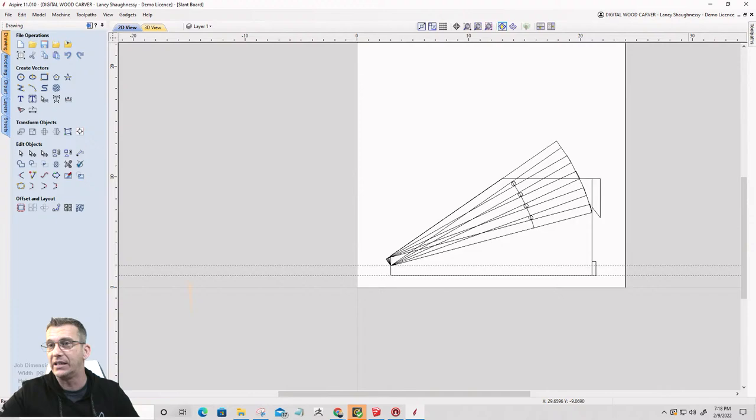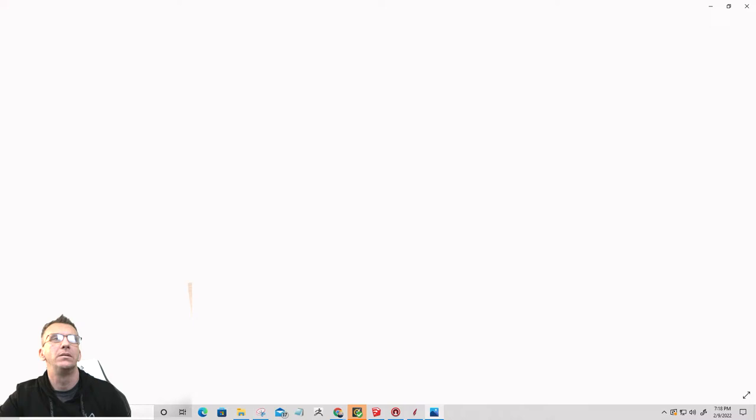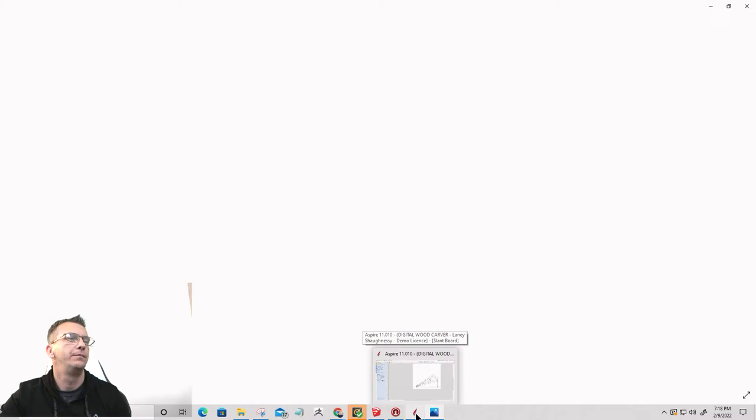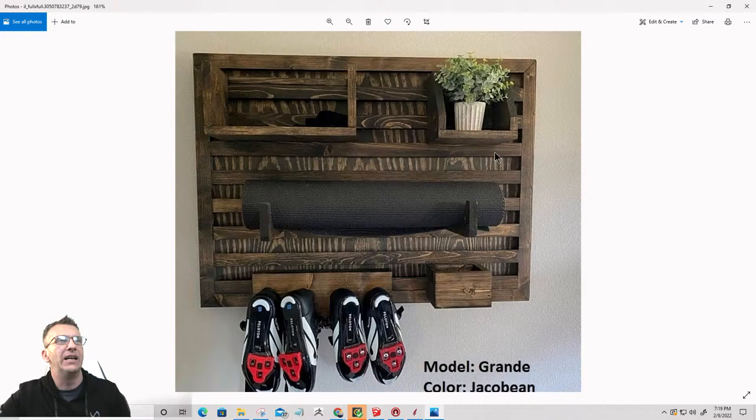For those of you that are new to woodworking and not quite familiar with what a French cleat wall is, let me give you a couple of small examples. This is kind of a small French cleat wall — it is a wall that has these one-by boards that have a 45-degree angle cut on one edge, the top edge, and then our other boards have a 45 that hang and hook on. It's a great way to do all kinds of organization.